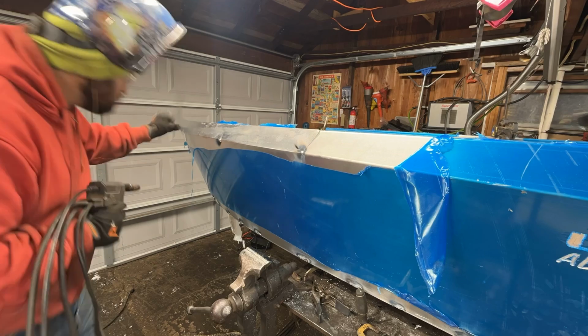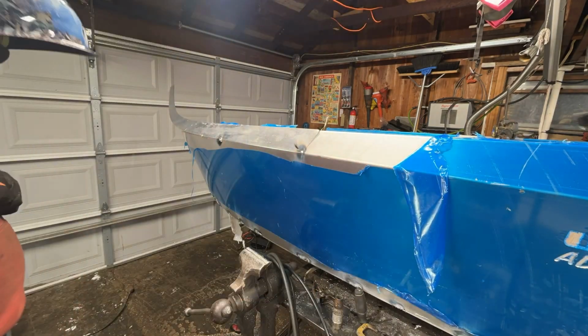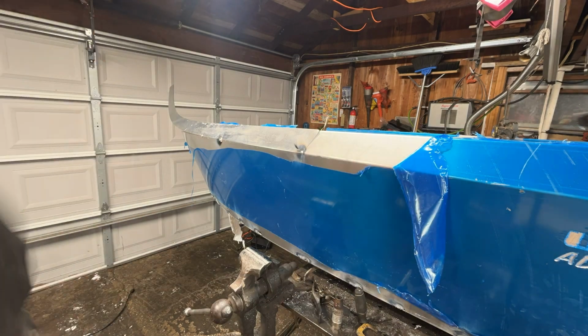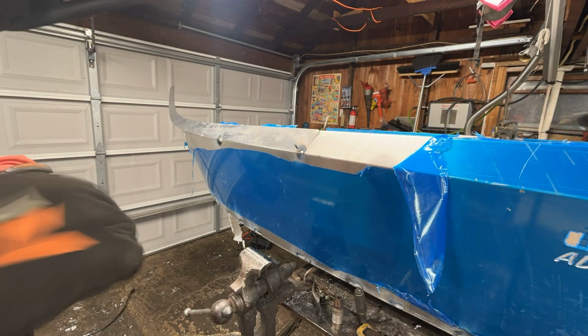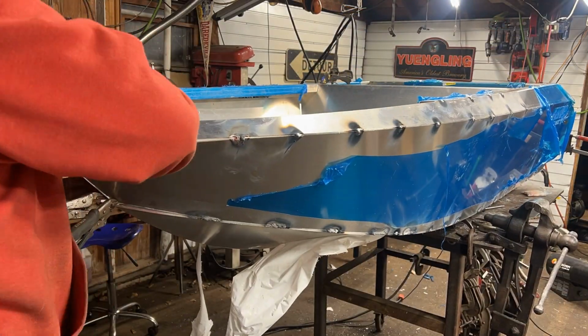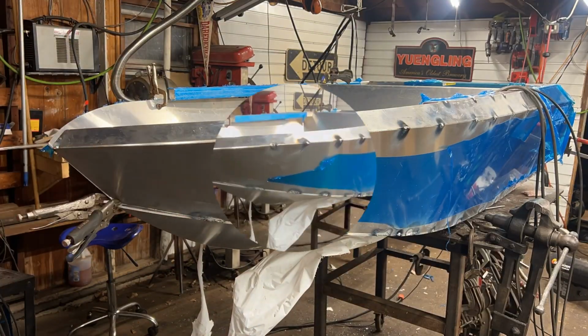Earlier in the video, I was complaining a lot about my XRA aluminum setup, and I ended up finding a big part of my problem was I have the wrong contact tips for it, as well as too much drive roll tension set on both feeders to start. Once I fixed that, it helped me with my burning tips a lot, but didn't solve everything. I would definitely say this project could be done with a TIG welder, but I highly recommend a spool gun or a push pull gun, at least for tacking.